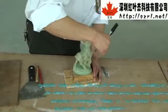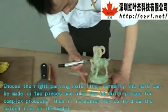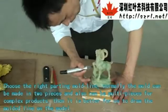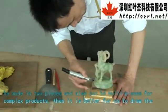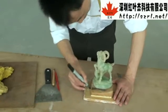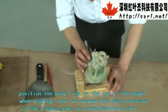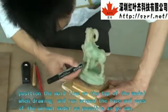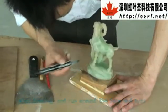Choose the right parting mold line. Normally, the mold can be made in two pieces and also can be multi-pieces for complex products. It is better to draw the mold line on the model. Position the mold line on the top of the model when drawing, and run around the face and eyes of the animal model as much as possible.